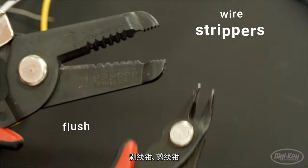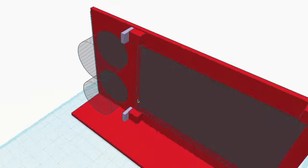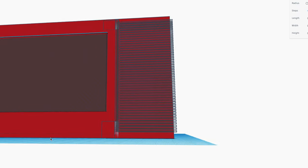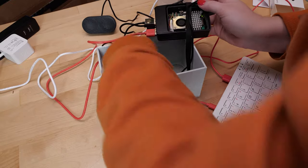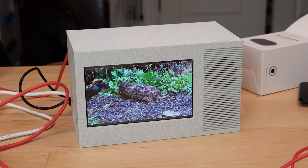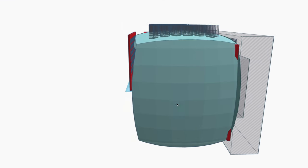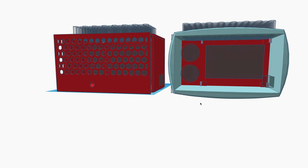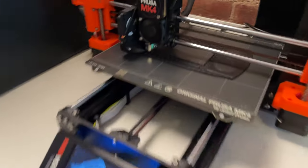To develop the enclosure a bit further, I played around with speaker grill patterns and settled on a segmented pattern with circles coming part way through. I think it's giving vintage vibes, and the marble effect PLA is super classy. I test fit the components inside. I used an HDMI cable that has smaller connectors than usual, so it didn't add bulk to the size of the enclosure. Once I was confident my basic shape would hold and fit all my components, I started playing around with the exterior shape, and also wanted to add some ventilation holes because the Raspberry Pi runs pretty hot. I used the honeycomb shape generator in Tinkercad to make grids of holes that are too small for my cat to reach through. I printed the final version of the enclosure in sparkly black PLA on my smooth build plate, so the front of the TV would be super flat.